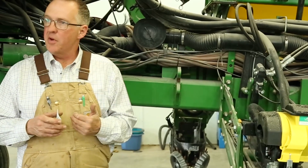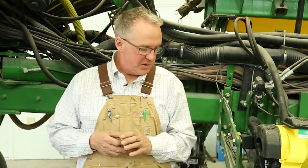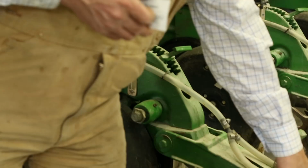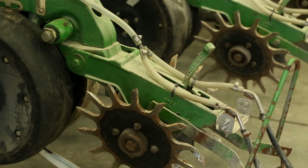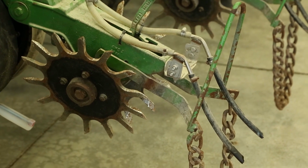were expensive, they were heavy, it was just another form of tillage, it required maintenance, and so we opted to take those off, and then we just put like a Y splitter where we're actually dribbling the nitrogen on the surface. We call that a 2x0, and that's where we're dribbling our nitrogen above the row, and we're splitting it on both sides.